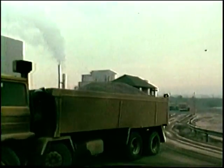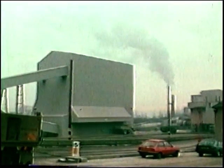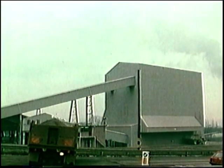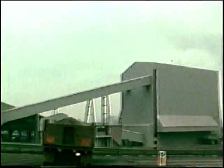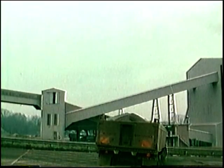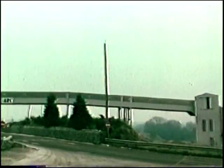Here at ARC Whittick, a yearly maintenance cover from Hoverdale ensures that belt cleanliness keeps the conveyor system working at peak efficiency all day and every day. These conveyors, fitted with Hoverdale scrapers under a maintenance contract in 1986, are still giving expected performance 7 years later. Inspections are carried out at 3-month intervals. The conveyors carry granite ranging from 150mm crushed stone to dust. The abrasive quality of this stone demands heavy-duty blades with tungsten carbide tips.